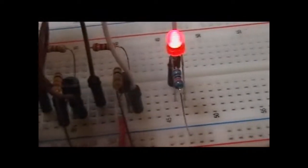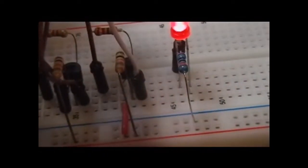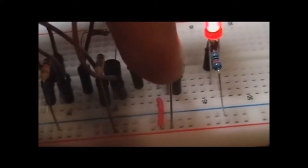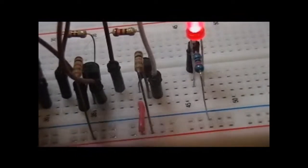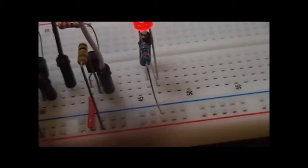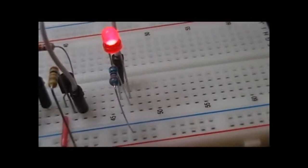Finally, the output from this transistor is sent to our sixth one, which is a staging transistor that simply inverts the negative logic to positive logic. Its output goes to the base of this last transistor. You'll see positive going to the emitter because it's a PNP transistor, and the resistor goes to the base to give it a positive potential. Only in the event that the fifth transistor outputs ground will this last transistor conduct, sending its signal through the collector, which is connected to the LED and back through ground.